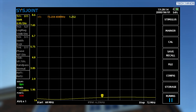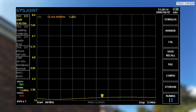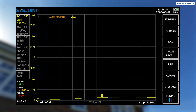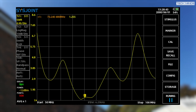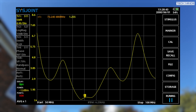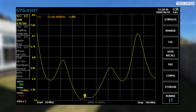With the antenna up in the air, it was time to check the SWR. This is a plot from 68 MHz to 72 MHz, and at around 70.2 MHz we observe an SWR reading of just 1.2 — in fact it's very broad-banded and around 1.2 across the entire band. For a wider span, this reading from 50 MHz to 100 MHz shows it has a lower Q than I've personally seen on other antennas, but it at least covers the whole band.